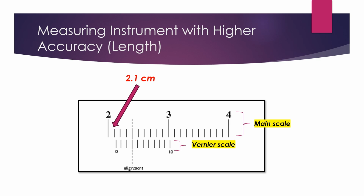In order to obtain the vernier scale reading, look at the image and look closely for an alignment of the scale lines of the main scale and vernier scale. In the image given, the aligned line corresponds to 3. Hence, the vernier scale reading will be 0.03.